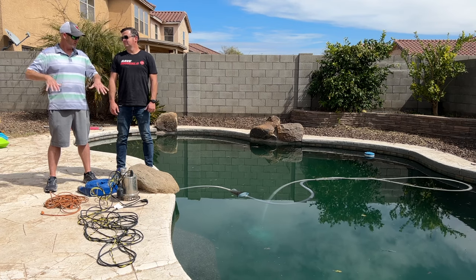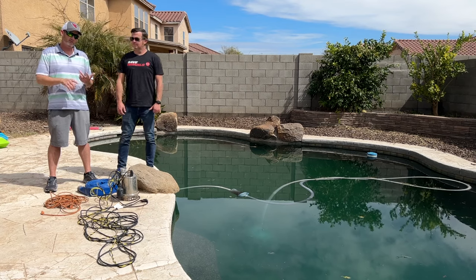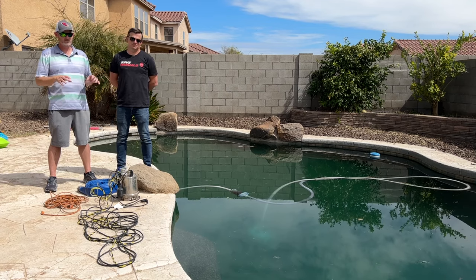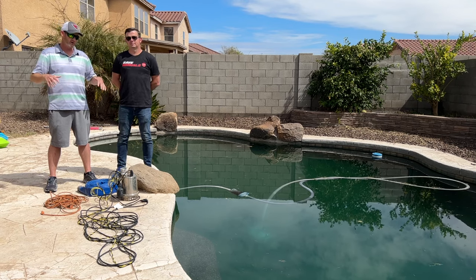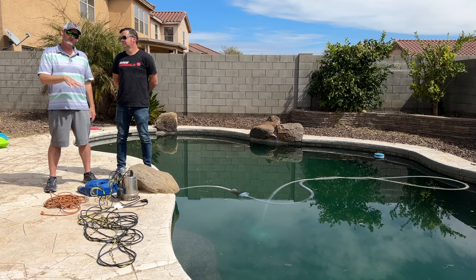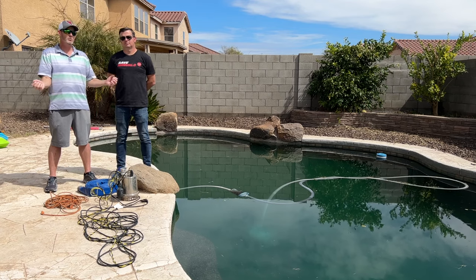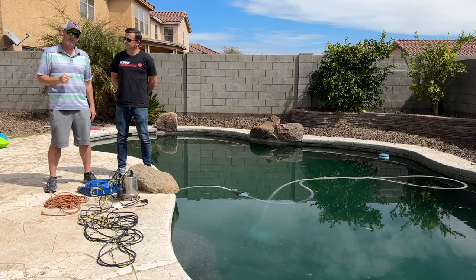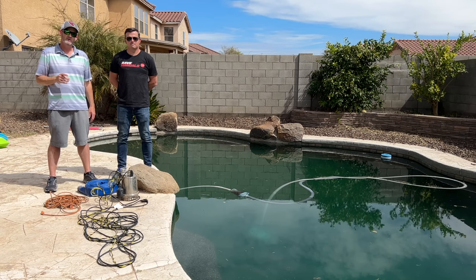This video and what we're teaching you is made for the greater Phoenix area. It's for a gunite pool, which is either plaster or mini pebble. Vinyl pools, you cannot drain all the way — in certain states you can't drain the pool all the way; it'll shift and you'll have massive problems. In Arizona, you can drain your pool as long as it's under 85 degrees for plaster and 90 for mini pebble. If it's too hot and you drain it, it will pop the plaster into pieces and the mini pebble can crack and be messed up. So make sure for mini pebble you're under 90, and for plaster you're under 85 degrees.